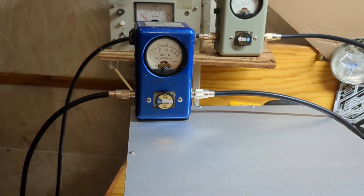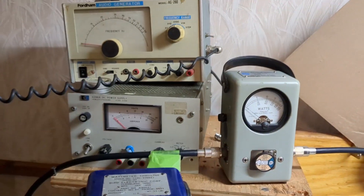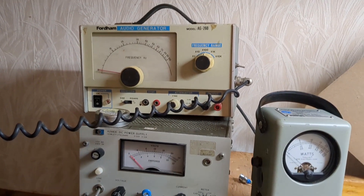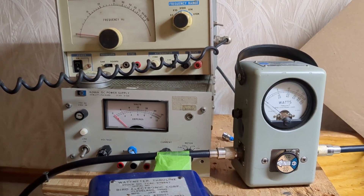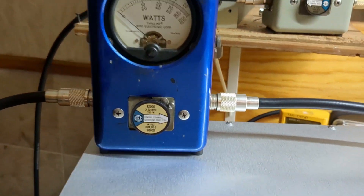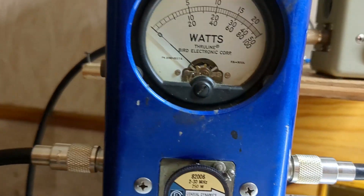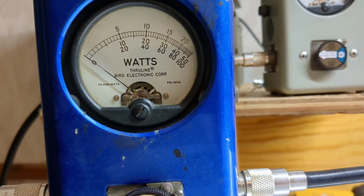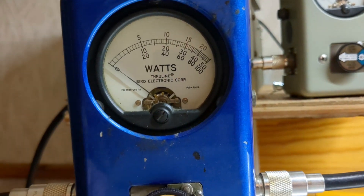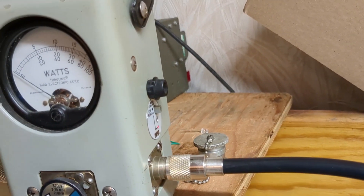The test setup today is slightly different — same driver and radio I always use, nothing different there. But instead of yelling into the microphone, I do have an audio generator plumbed into the radio so you don't have to hear me yelling audio. It just puts a one kilohertz tone through the mic input and keys up with this switch, making things a little quieter on the video. We're going to be looking at this Bird 43 peak reading meter — this is the driver meter. We've got a 250 watt slug on peak, top scale: 25, 50, 100, 150. Over here we've got a 2500 watt slug on peak, top scale: 250, 500, 1000, 1500.